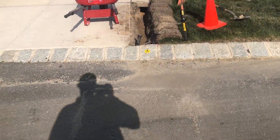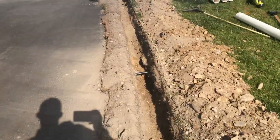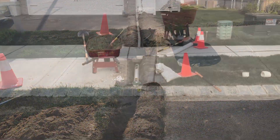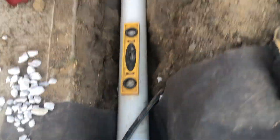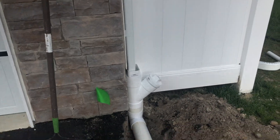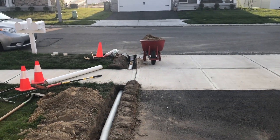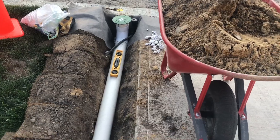The front right side of the house is done. We've already done the left side, backfilled everything — it's under the sidewalk and under the sprinkler lines. Now with the right side, we have the pop-up on at the end. The bottom has rock as a mini dry well; I'm going to burrito-wrap everything over it. We have the sprinkler line down the side, everything running downhill extremely well, picking up this one downspout on the side. Water's going to come out, rush to the pop-up, build up, overflow onto the street, and facilitate down to the nearest storm drain.